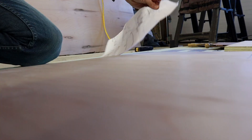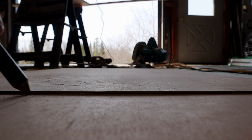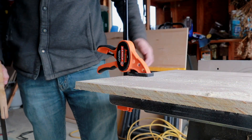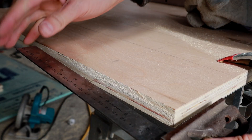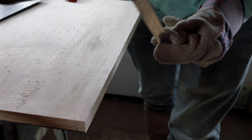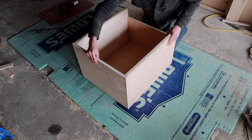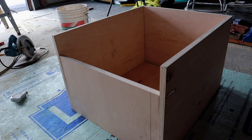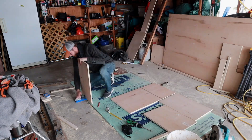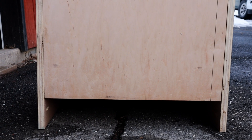With that accomplished, I set out to rough cut everything to size and get ready to build this drawer. Don't forget, because we are making an extra slide-out from this drawer system, you are going to want to cut a little extra space off of the face measurement that the website spits out. That way we're going to have some room to install some guides as well as that pullout board itself. With that done, we are going to drill some pocket holes, get it all together, and move on to the next step.